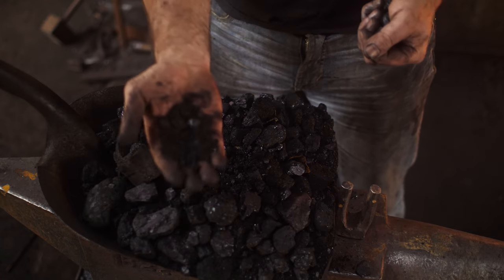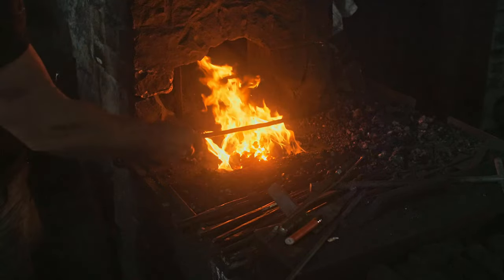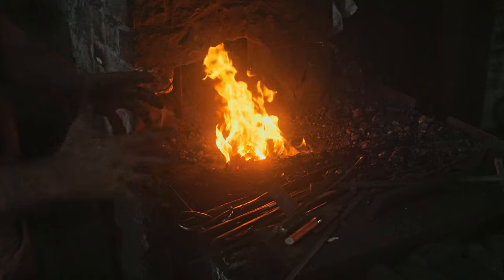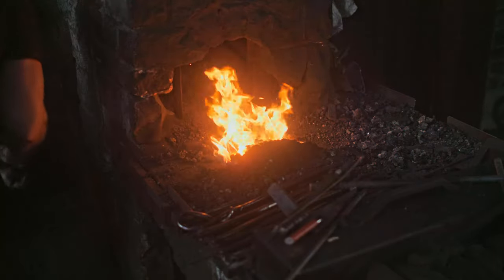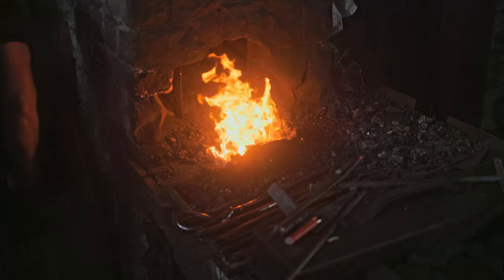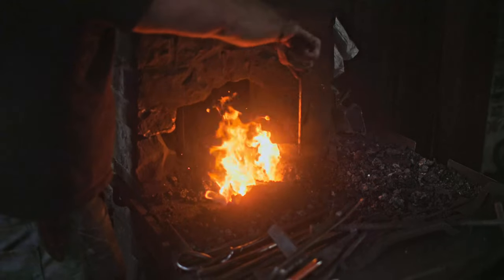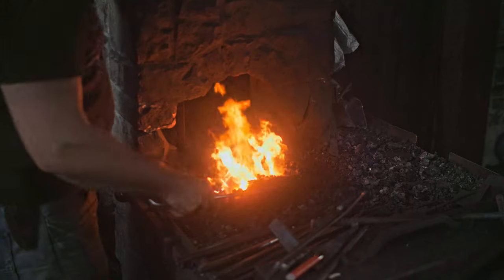The key to using coal with fines is keeping the coal wet. We always keep our coal in a bucket of water and put it on wet, and that's for a number of reasons. I've got my fire going here, the coke is ignited and I've got a good fire going. Now I'm going to start putting some of the green coal or wet coal on. I've gone through my pile and picked out a pile that has a lot of fines in it — it's almost half powder — just to demonstrate what I'm doing here. What I'm doing is putting coal around the perimeter. I always leave my front side open, but I'm putting wet coal around the perimeter of the fire. That concentrates the heat into the center, heats up the steel where you want the heat, and doesn't bleed heat out or make it uncomfortable to work with.